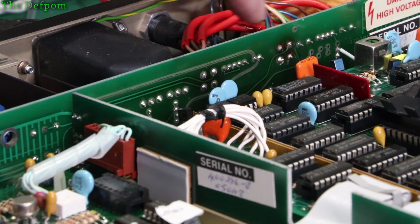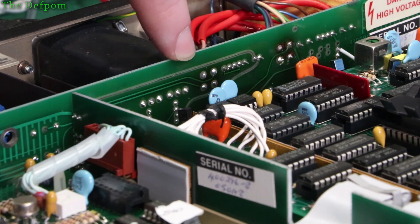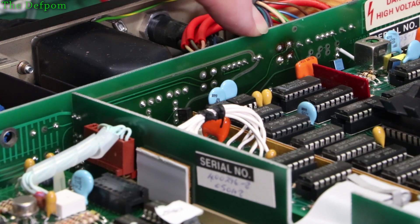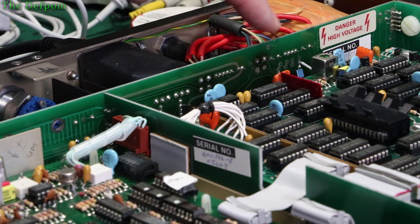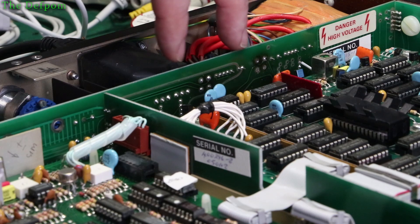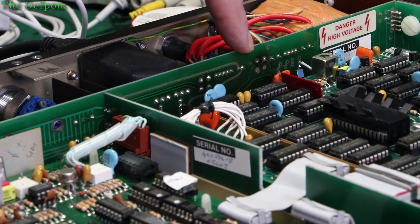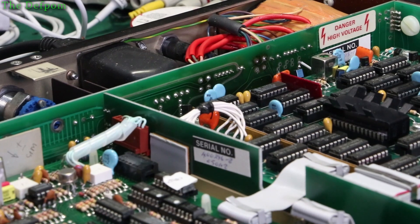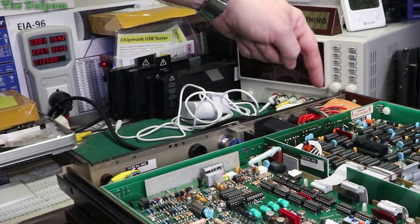I've just removed W1, which is the bridge rectifier for the 190 volt rail - that's where I was measuring 240 volts before on that capacitor. You can see it's been getting hot and is all charred. I've removed it and let's power it up and see what happens. That's better - 15 watts and the noise is gone. So yes, I know now which power rail is the one playing up - that narrows it down quite a bit. Let's measure the diode bridge and see if there's a bad bridge or if it's the main power supply rail. Often it's the rectifier which is the problem.